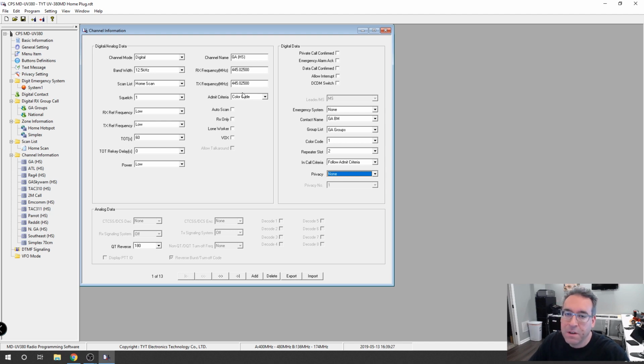Fairly easy. I suggest getting a code plug demo that's out there to start and build off of that, but there's no reason you can't just start making your own. That's what I did. That's how I got mine going and was pretty successful at it. Across the bottom in the CPS, which by the way, you're going to see CPS all over the place. That's just code plug software. I don't know what it actually stands for, but I call it code plug software. It's what you need to program your radio. Customer programming software. I believe Motorola probably coined that term a while ago.